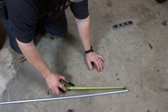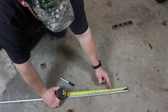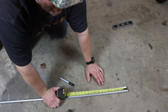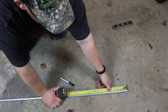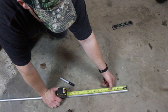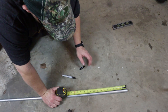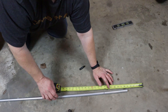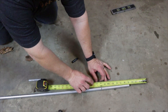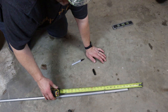So what exactly does five-inch take-up mean? You're going to subtract five inches from 12 — that gives you seven inches. There are two ways to do this. You can take 12 minus five, which is seven inches, and mark it at seven. Or there's another easy way with no math: take your tape measure, hold over the very end at five inches, and the mark at 12 inches is right there on the scale. So the take-up is five inches and we want a 12-inch 90 — let's see if that works.